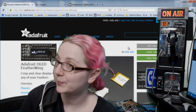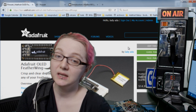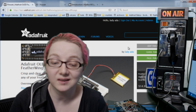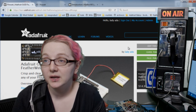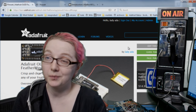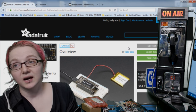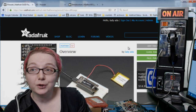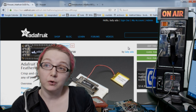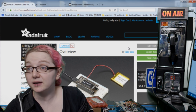What language do you use to program all this? We use primarily Arduino, C++, to program the ESP8266. It has the most example code. It's well documented, and people use a lot of it. Almost everyone using the ESP8266, which is the chipset in this ADABOX, uses Arduino. However, you don't have to. You can use Lua or MicroPython. Those are also two supported languages available for this chip, and all of the components that we add can be used with it as well.